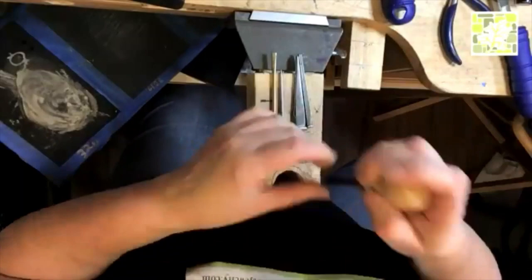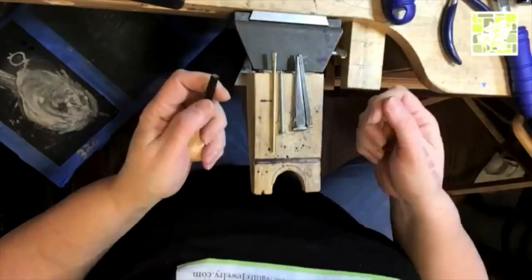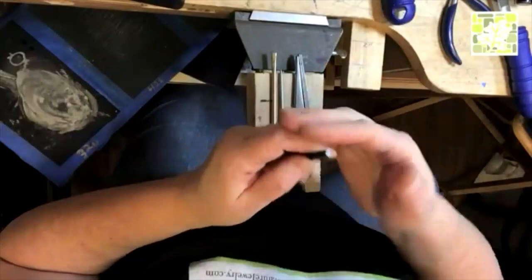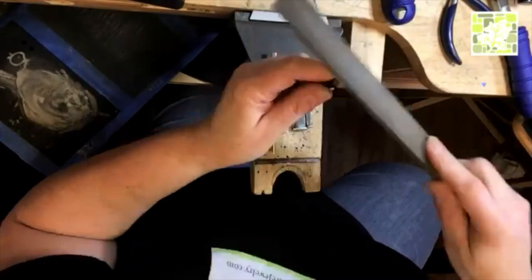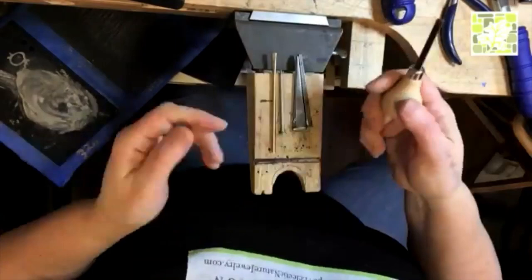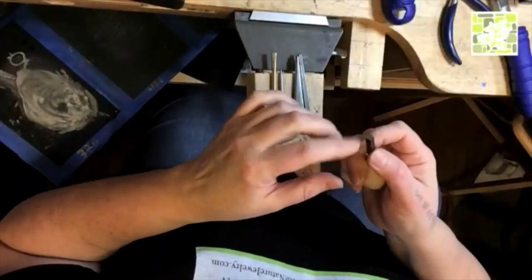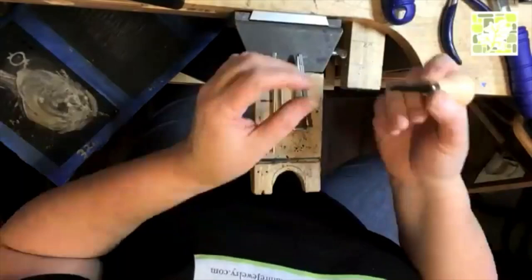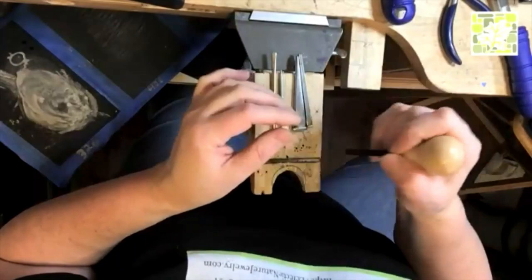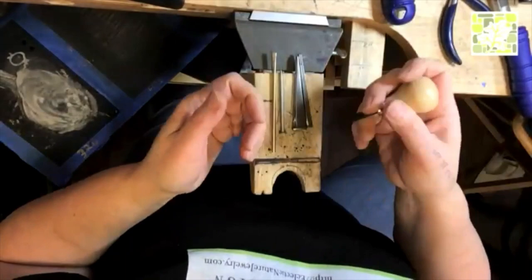John doesn't talk much about cornering, but when you watch him prep a tool, he does sort of just do it by the way he files. So he files things a little bit smooth. But the piece that he does that blew my mind is on the end of this, once you've got it blunted, he takes a file and just goes bip, bip, bip to the end of it a little bit and coarsens it up. I had always been taught that you high polish these things because any mark on it is going to potentially transfer. But just that act of putting a couple little passes into it has changed how much the grip is. One of the reasons we scratch our stones is we go slipping across, right? Having a tiny, tiny bit of grip, which you're then going to buff out if it makes a mark using either files or sanding equipment, or he uses the felt buff wheels on his Foredom, that little bit of grip makes all the difference in the world.